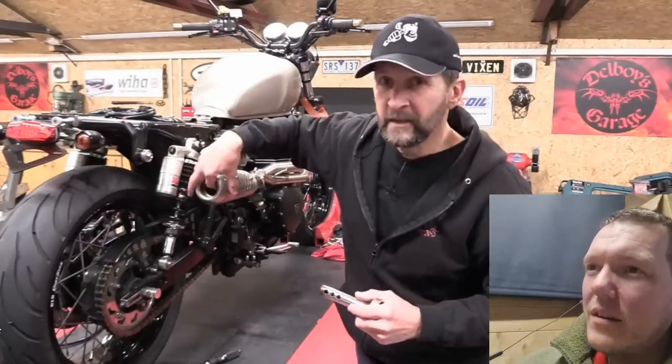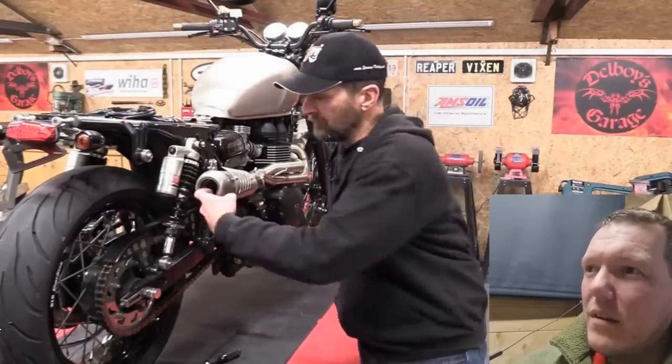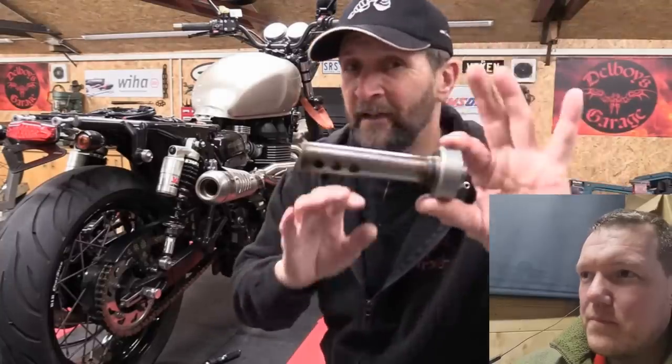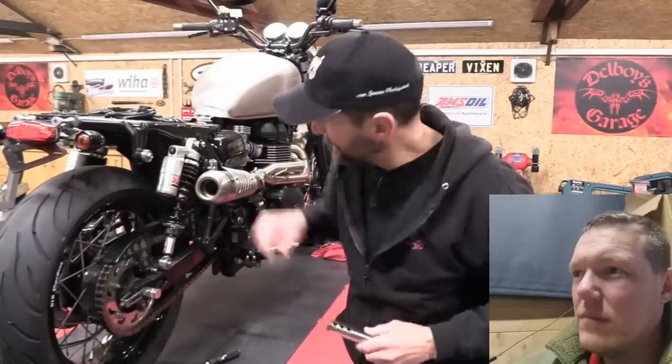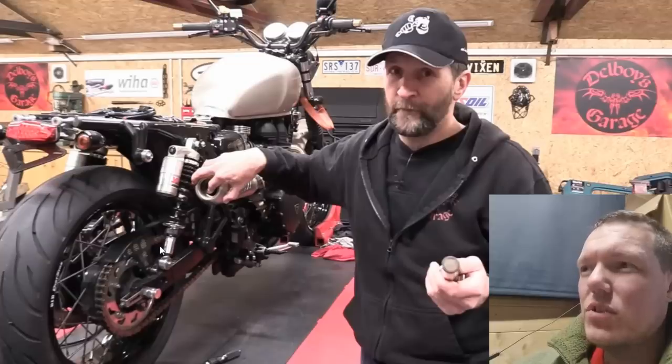The back cap, and inside there's that perforated steel tube. And you get a little piece of metal with a hook on it, reach in and just hook it out. Like a spring hook. Because there's nothing holding that in, other than the baffle. Now, if you want to run the bike, as I do, with no baffle, then there's nothing holding that tube in. There's not even the circlip that stops it coming out. What stops it being fired out?